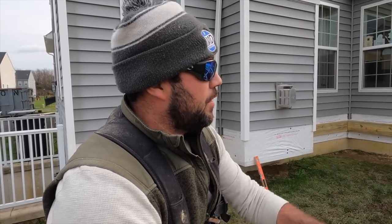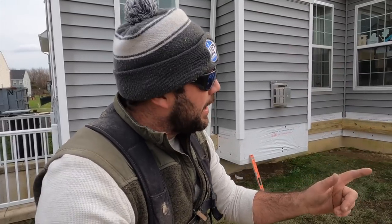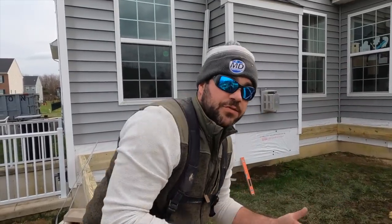So we have all these beams, and we're also throwing triple joists on both ends, running railroads. They're going to be our point loads for our six by sixes for our roof. So the first thing I want to do is get these triples ran. And this is where you try to be square, you try to be perfect, but I'm more worried about both of these triples, the numbers running the same in parallel. So the project could be a little bit out of square, but you'll never know.